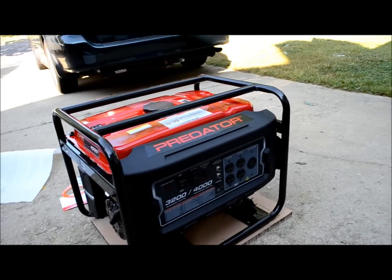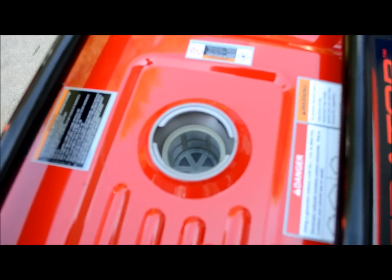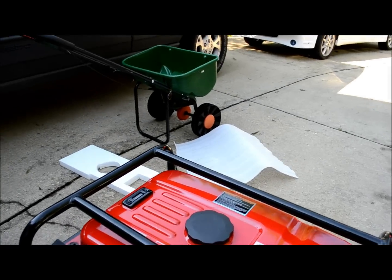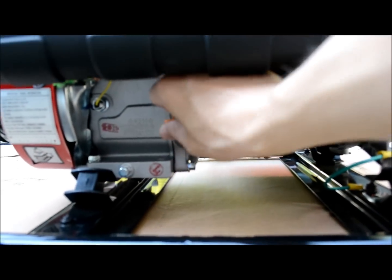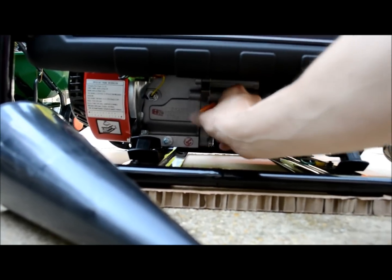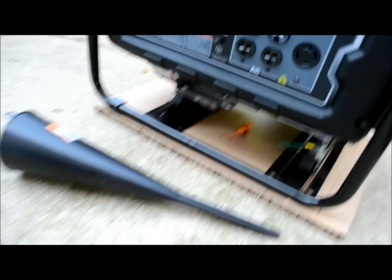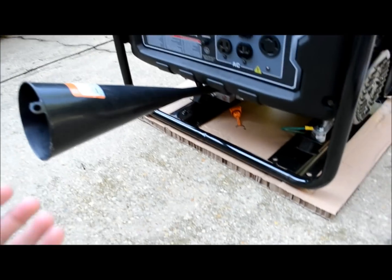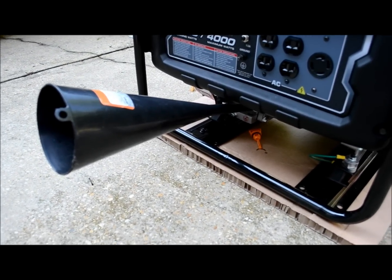I took the camera off the tripod to show you where the oil is on this model. Step one is to fill the gas up — it's got a nice gas filter on top with a great screen inside to protect from particulate matter. Step two is to add engine oil to the crankcase. On this model that's way down here, about six inches off the ground underneath the unit. Since it's warm out, we're going to use 10W-30, the weight for warm weather. Because of the awkward position, I'm going to use my trusty long-neck funnel. Then we'll add the gas and give it a crank.